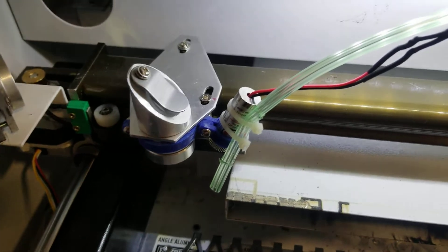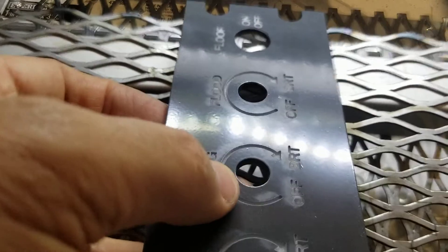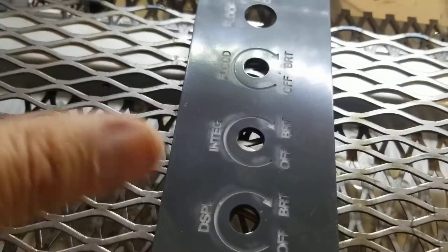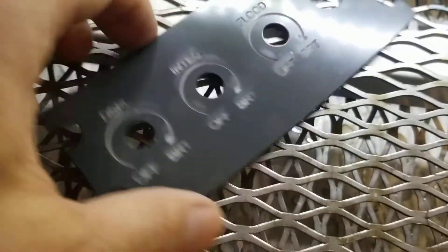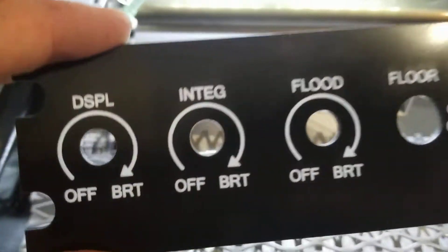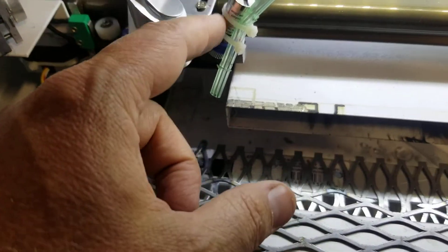As that laser is shooting down, it's moving any of the debris — when it's burning that acrylic or paint on that panel — it's moving it out of the way. If you don't do that, you can see these burn marks; it almost has a smoke ring around all the lettering and you can see where it's not polished off as well. That's because around those edges the laser burned but it didn't have anything to blow on it. This is before I set up the actual air. You may have to play with it a bit, but it'll remove that ugly unnecessary blemish.